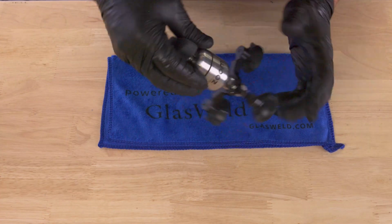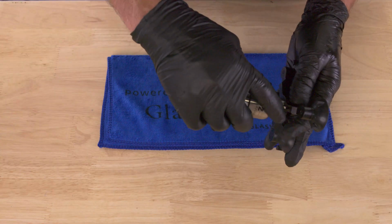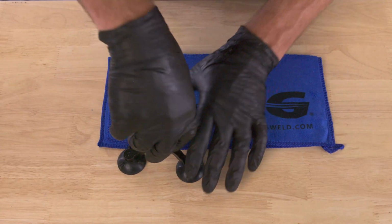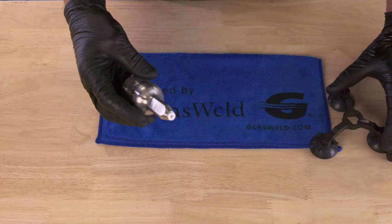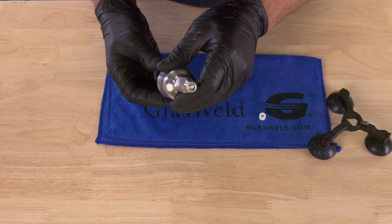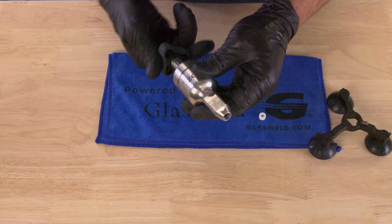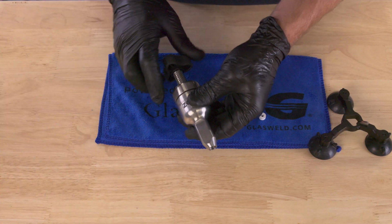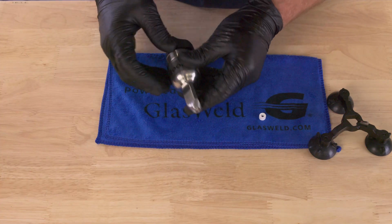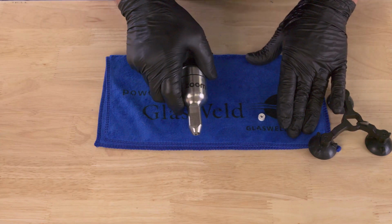What we recommend is when you remove the injector from the glass, usually it's in an injection state, so just leave it there. Pull it off, set it down like so, which is better if you're working in the sunlight anyways. And if you remove the injector from the tripod, immediately pull the little white seal out and turn it this way, all the way down. Don't turn it the other way. Don't turn it back, because that's going to allow the resin to flow into the upper chamber. So just make sure it's all the way down. And if you have a little excess resin there and it's sitting on its side and it's threaded down, nothing's going to happen. The seals are going to be just fine.